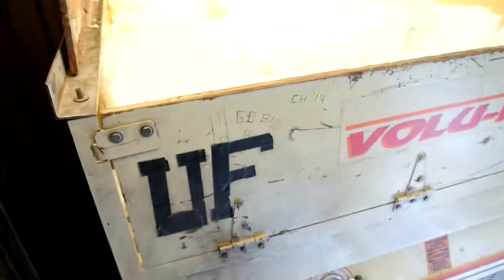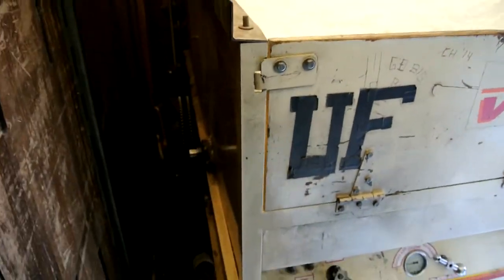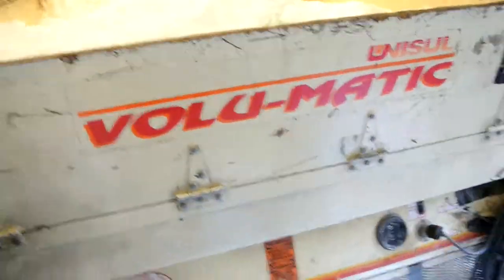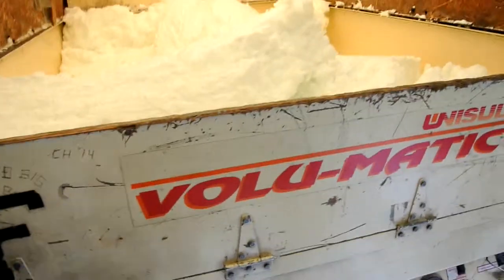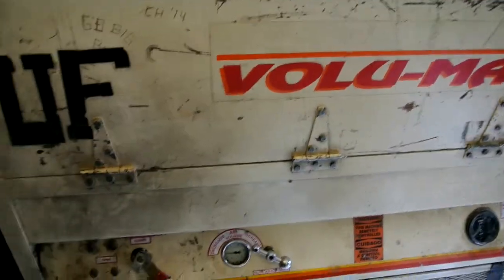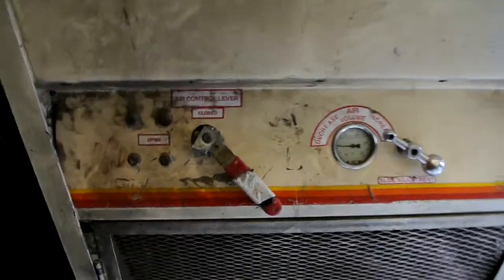This thing here is driven off of a PTO from the truck. And he says it's running about 1,000 RPM even though the tach's not working. It's about a 1-to-1 ratio with the transmission and drive. It's going to be about 4th gear.